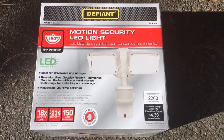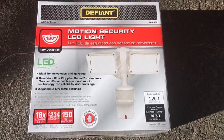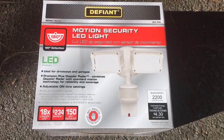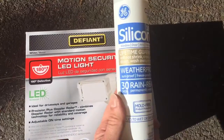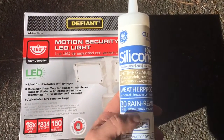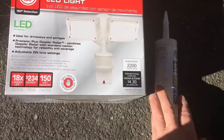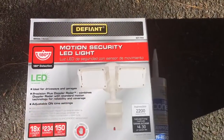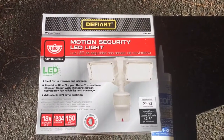I've got a video that shows you how to install a floodlight, so if you're not sure how to do it, it's pretty basic — I'll put a link in the description. When you install it, you're going to want some silicone for the base, made for outdoors. This one's clear and it's made for siding, so I'm going to put some silicone on the base to help protect the back side from the weather against the siding of the house.